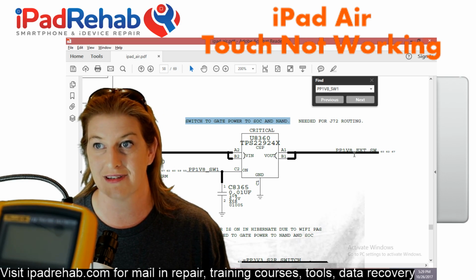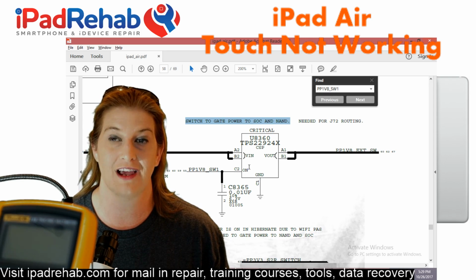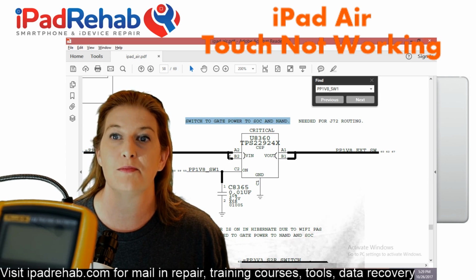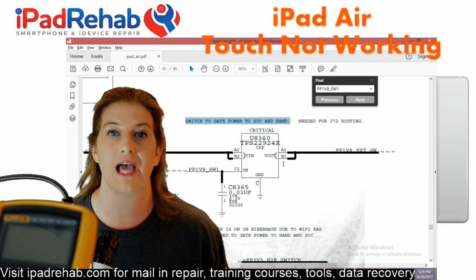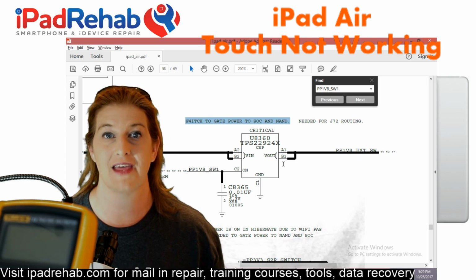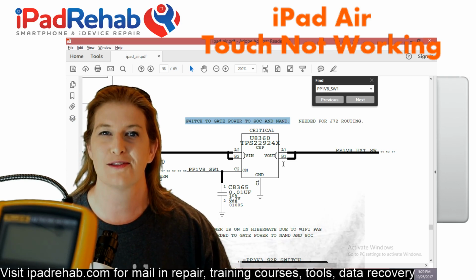So we looked, is that present? Nope, it sure isn't. So what we suggested was, why don't you take the rest of that chip off and then just lay a jumper to bridge V in to V out, so you can rule it out just for troubleshooting. So we did that, and then he tried to restore without the NAND, and he did get error 40. So there you go.